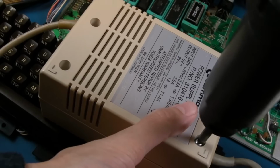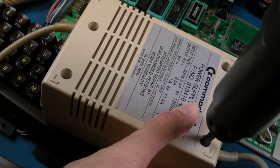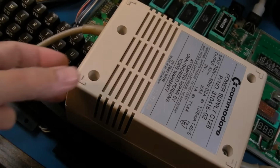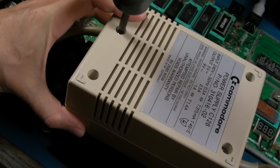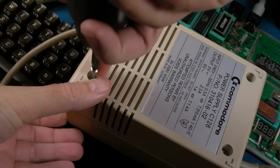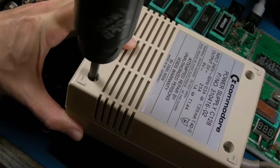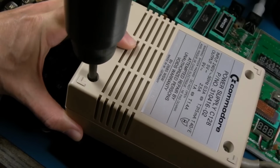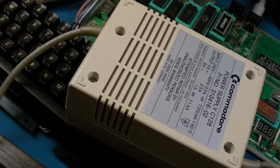So you don't always have to do Retr0bright, and in fact I would go to sun bright before Retr0bright, which is not something I thought I'd ever hear myself saying. I think it's the reason why so many things get yellow: they've had no sun. Nearly every single thing I put back into a box in a dark room goes yellow, whether it's sun brighted or Retr0brighted. So it's lack of light that causes the yellowing. There may be instances where the sun causes the yellowing, but I keep seeing the exact opposite.